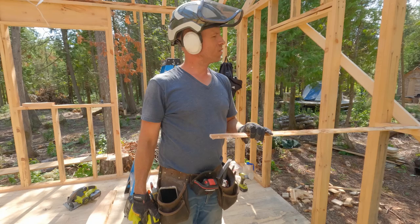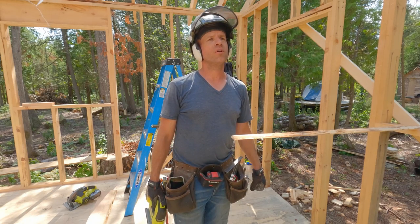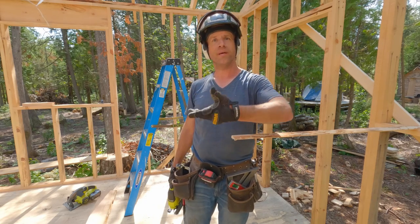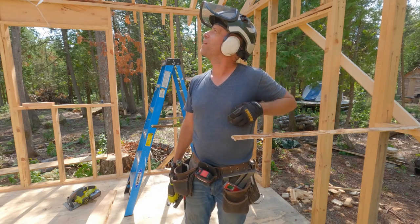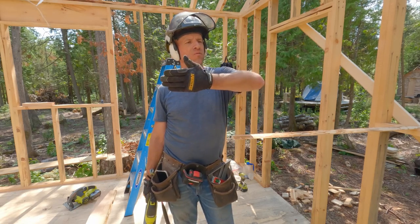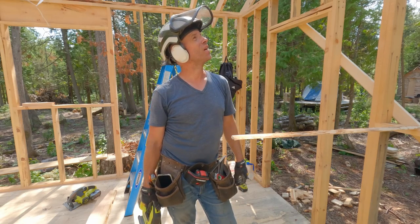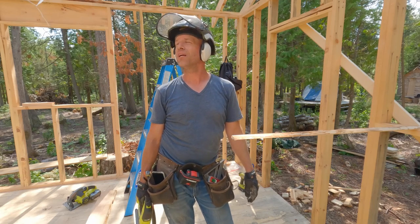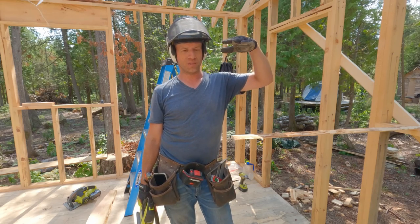I measured the boards I have left, they're 12-2. So that would work, but if you put a 12-foot 2x4 spanning the whole thing like that, it's going to sag in the middle, and then I have to attach it again to keep it from flopping down. So I'm just wondering how long a span I can make with a 2x4 on edge before it'll start sinking and making the roof saggy. The good thing is it's going to be all cedar on the inside, and that cedar is crazy light. It's like balsa.